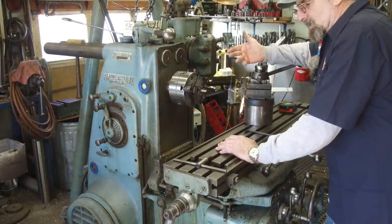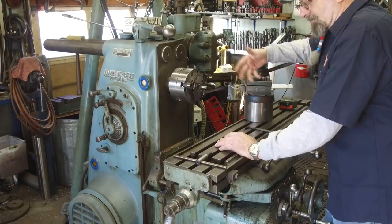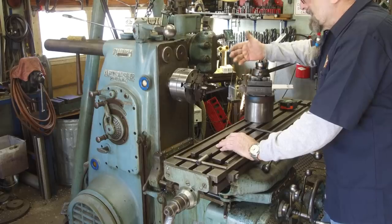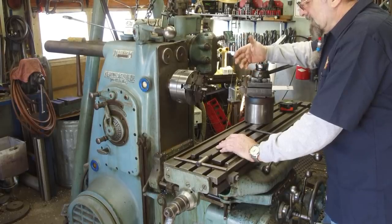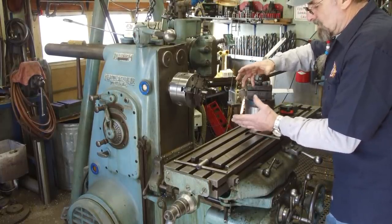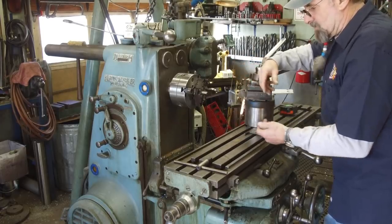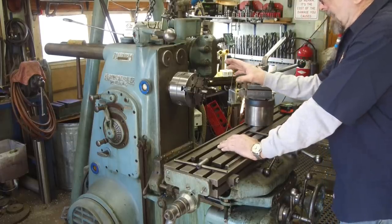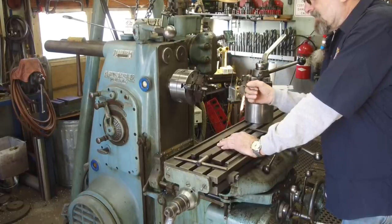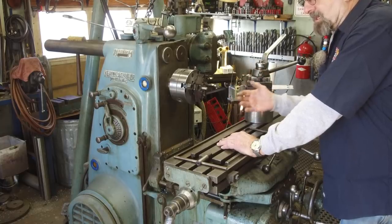One question was, why go through this effort to make this a lathe function when you have the big K&T and you have the Rutland lathe in the other room? And simply because we're not trying to turn this into a production lathe. That's just not feasible on here, and rightfully the question was, you know, that's what created the question in the beginning. By putting a chuck on here, we're able to take this universal mill and give it another aspect that might be used in the tricks of running an HBM.